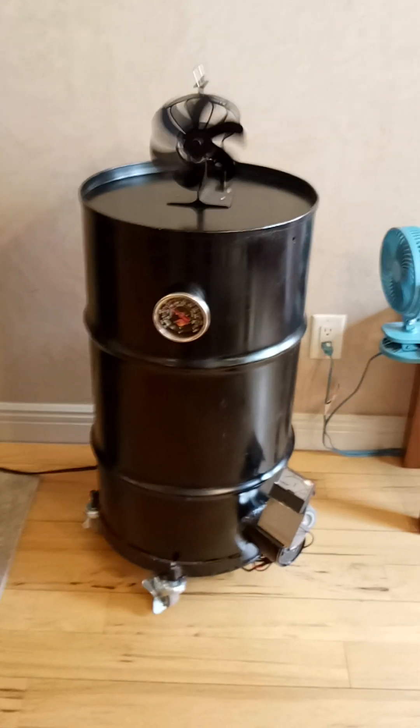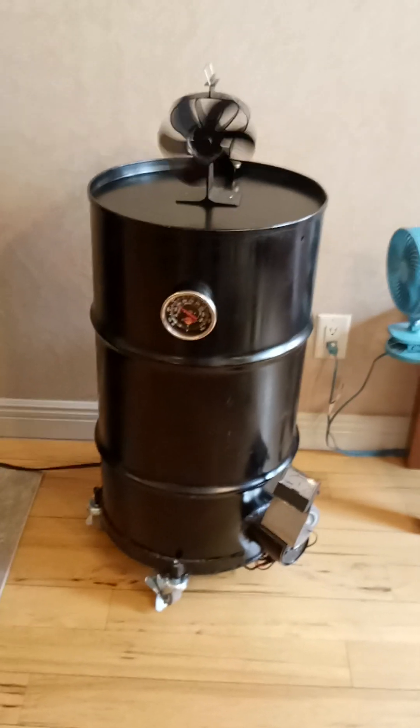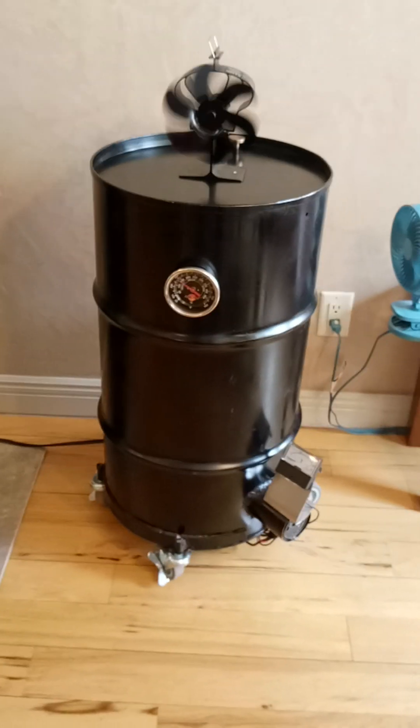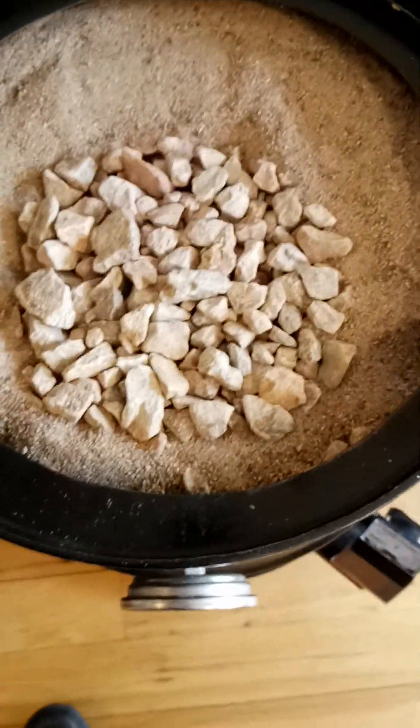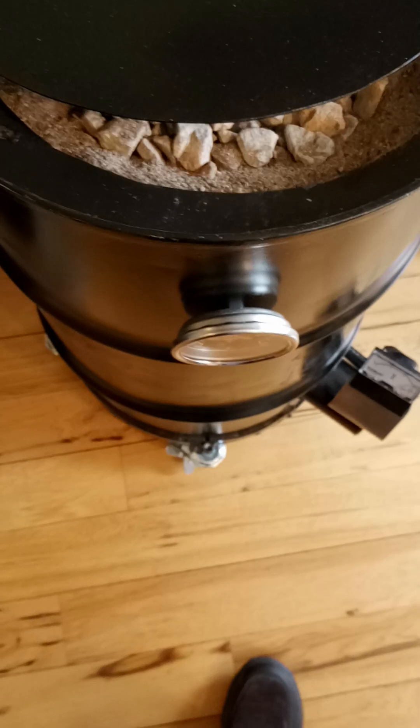This is my bigger one that runs directly off the solar panels. I found out I can put a lot of heat into it but I have a hard time getting all the heat out of it. So I put a fan behind it to help blow the heat out, or I've got a fitting in the front where I can blow air up into it and up through the center. Those rocks get pretty darn hot in there — that air blows up through them. I put the lid on and leave it cracked a little bit so the heat can come out and dissipate faster. I found out if you don't get the heat out before you heat it up the next day, it accumulates and I end up burning up the elements if it gets too hot.